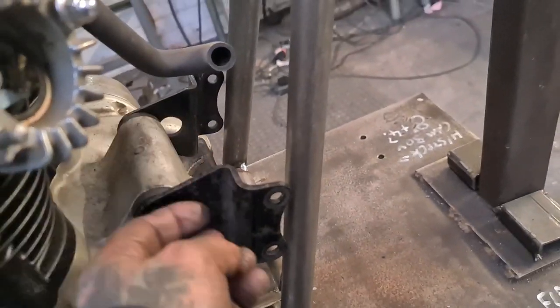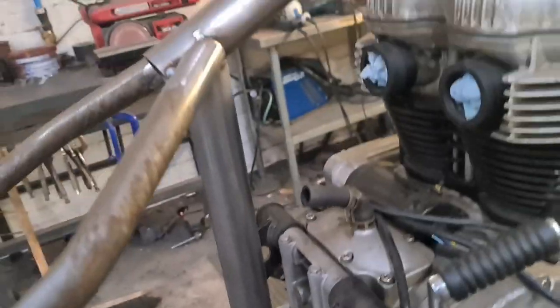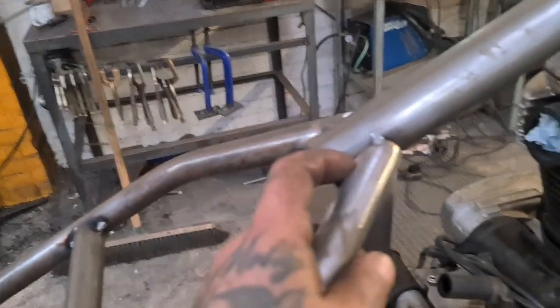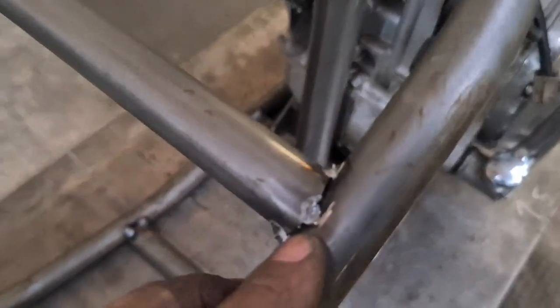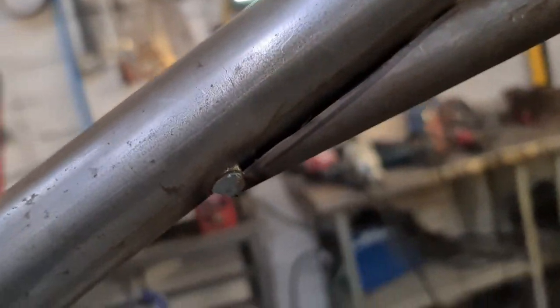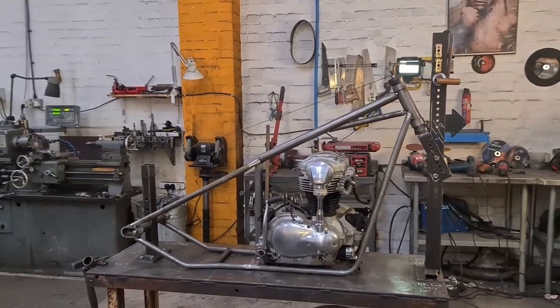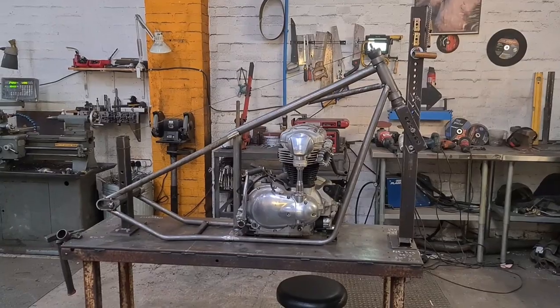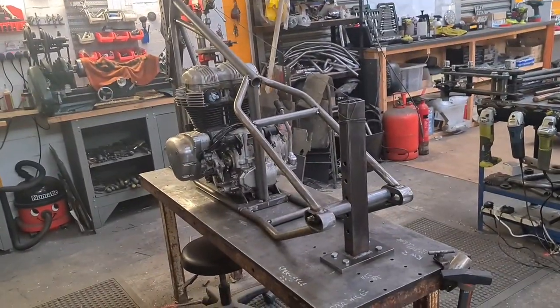I'm going to utilize the standard mounts, so it's over to the lathe for making bosses. I've got that bottom mount on. I've had a bit of a shielding gas issue - I had a leaky hose, which was going to mean porosity. So I've ground out my tacks here and there and redone them. The frame's done. I pulled a late one and a long one to get that tubing in. The suppliers have come good - sent me spares, apologized, and paid extra to get stuff to me free of charge.